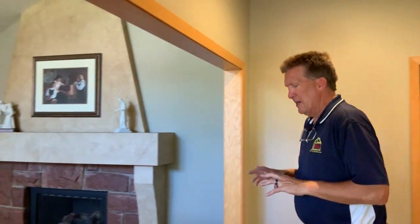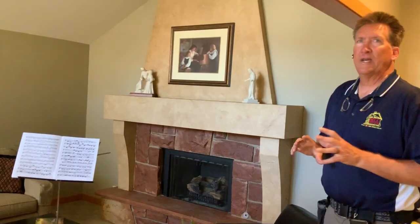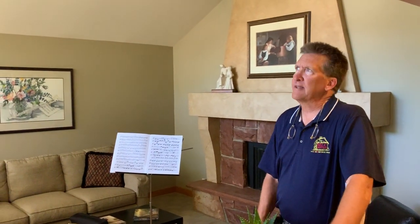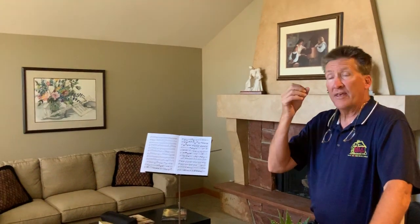As we come through, the thing that dates it, windows. During the time when they built the place, they just converted over to dual pane windows. These aluminum frame dual pane windows at the time were the best you could do, unless you tried to go with the early wood dual pane windows. Those ended up with rotted frames and things like that. The issue with these windows is they sweat. These windows do not have any low E reflectivity, argon gas, nothing like that. And they tend to leak at the corner joints.